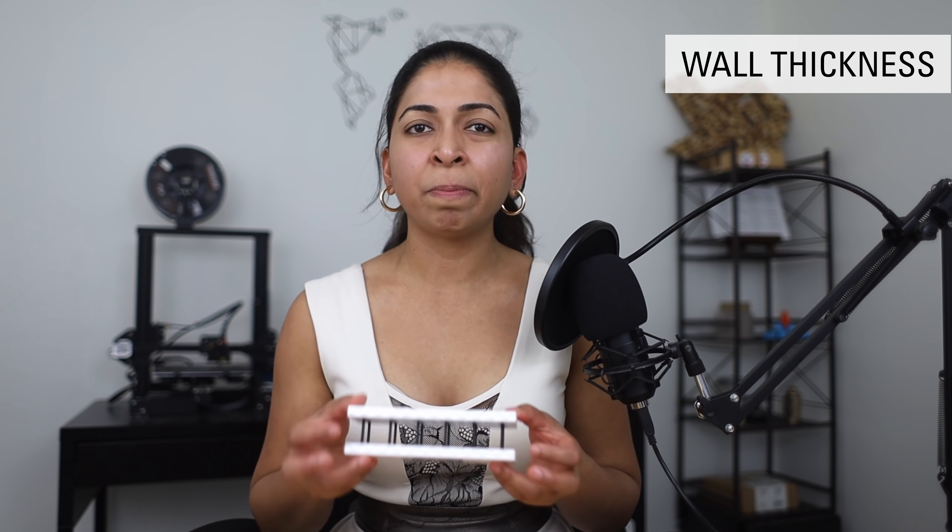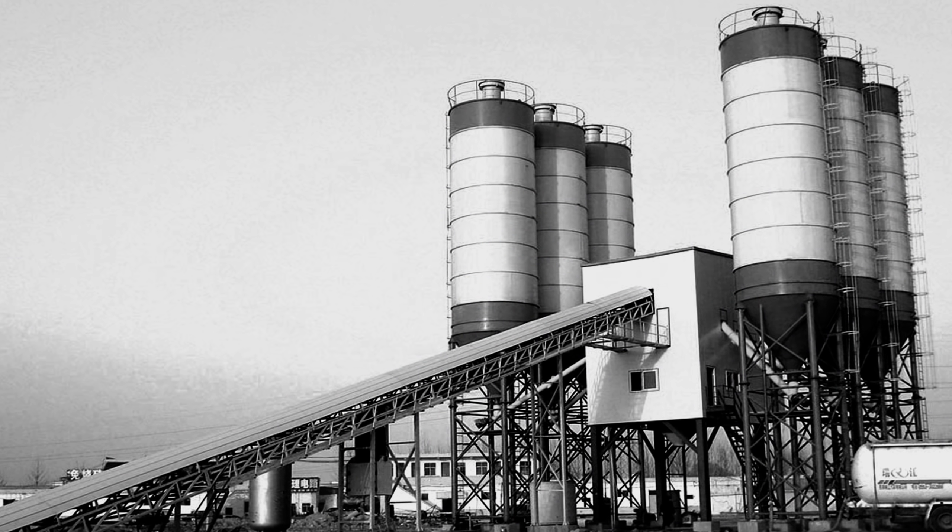ICF homes can have humidity issues if they aren't properly ventilated. The walls also occupy a lot of space — a 6-inch wall is actually more like 11 inches, which can eat into your interior space. Sustainability could be another concern, as concrete has a massive carbon footprint and is destructive to the environment, though you need to compare this against the 100-plus year lifespan of an ICF home versus a poorly built wood-framed home. Remodeling the exterior walls of an ICF home is nearly impossible — you'll have to jackhammer through the concrete to modify it. It has to be carefully planned to avoid routing through EPS foam to run cables, whereas wood construction is more forgiving because you can hide your mistakes.